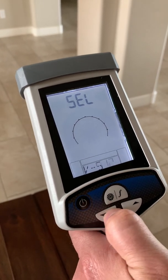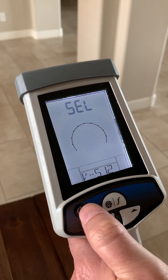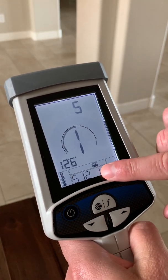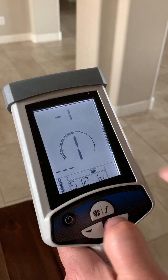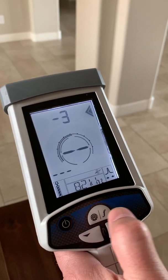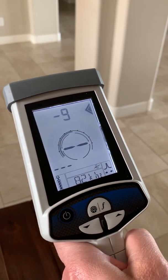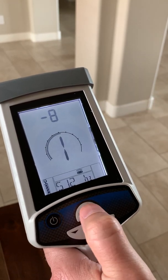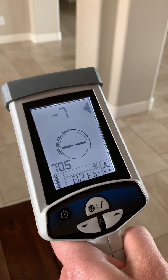Going back to Version-512 and doing a short press of the power button, you can see 512 hertz sonde mode. Short pressing the frequency mode button gives 82 kilohertz refined peak with arrows, and that's all you can do with that version.